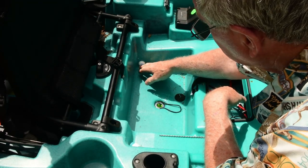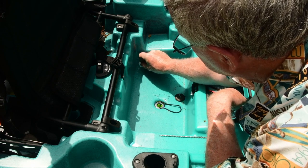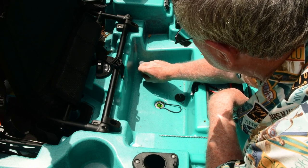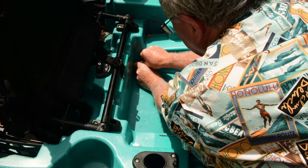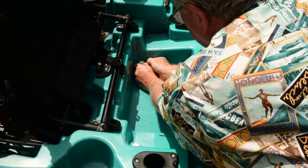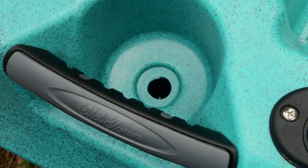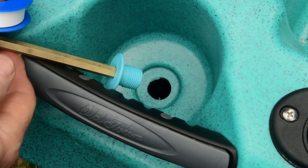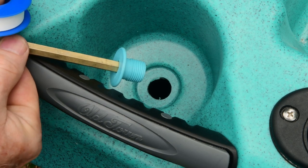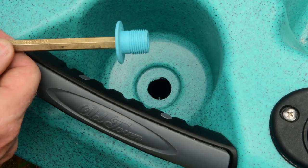This is all that you've got sitting out — the blue piece won't be here. It's going to sit back just like that, and that's what your finished install is going to look like. We're going to show you how to hook the tubing up in just a second. The cup drain is designed so that a 5/16-inch Allen wrench will fit in it, and that's the easiest way to handle this thing.